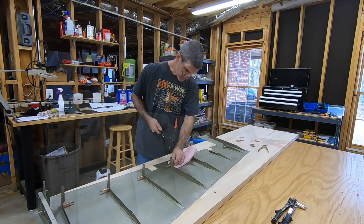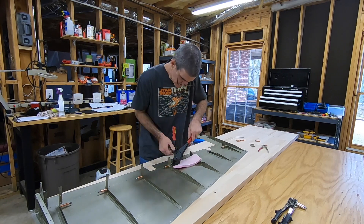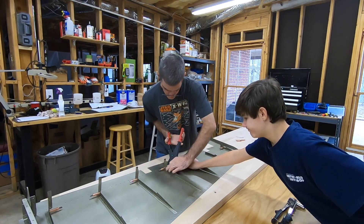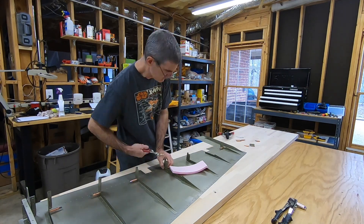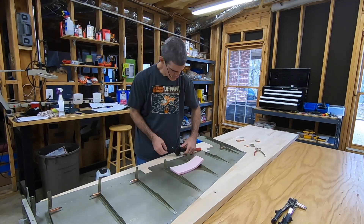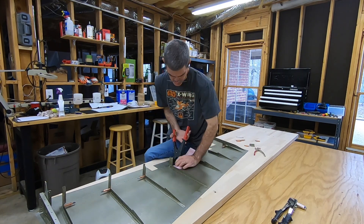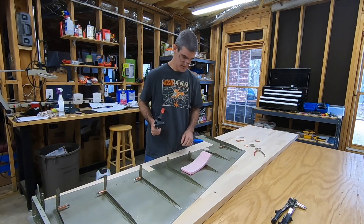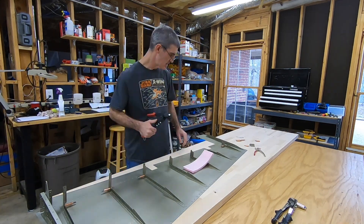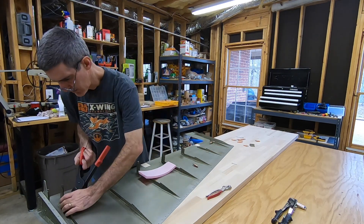It's yet another tiny little cosmetic issue to mark a lesson learned. From then on, I use this foam rubber and I really just rotate the head of the squeezer so that I'm not bearing down on the skin. This control surface skin is really thin and really susceptible to that kind of thing. I just should have been more careful or should have thought about what would happen when the pop rivet would let go.